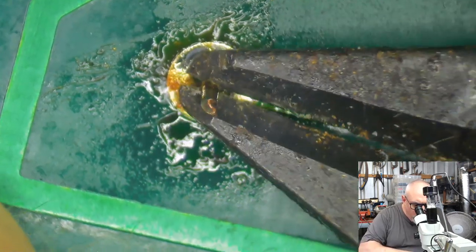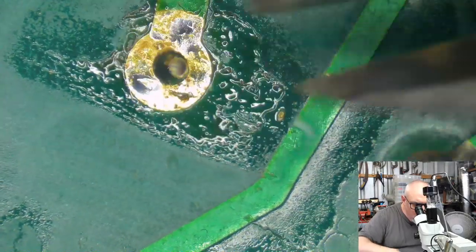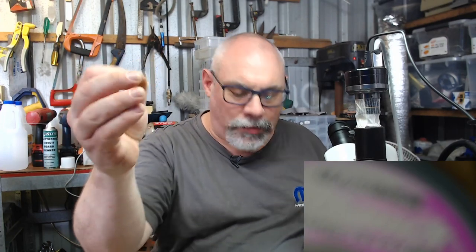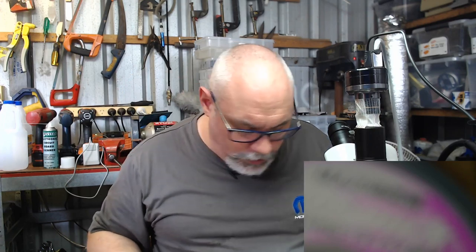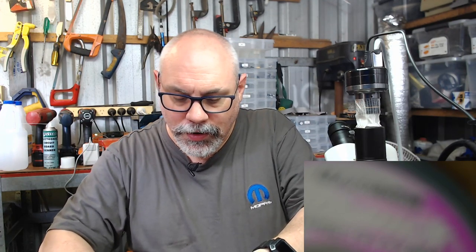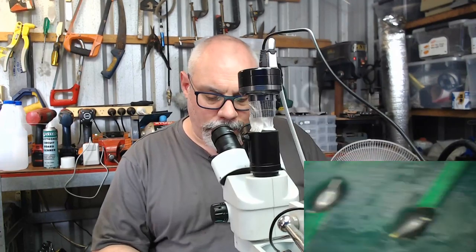Let's do the same. I like to, as I have said before, bend these pins up before I just yank them out. I just feel it's a lot safer with an old board like this. And bendy bendy. There we go. And then out comes our little 33 kilo ohm resistor. There. And then here's the great big fat replacement they're going to be putting in. This one's future proofing. Okay. And once again, just be aware that this is R55 on the international board, but it's not on the US board. All right. New resistor on the board. And then we'll come back here and do some more soldering.